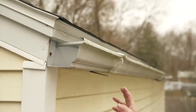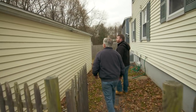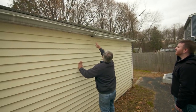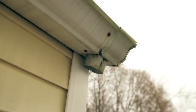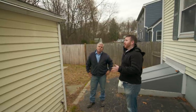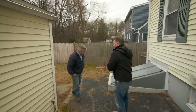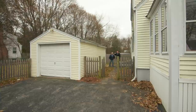There's no end caps here. Brackets are falling off. The spikes are coming out. This joint definitely looks like it will leak. There are no brackets on that gutter. You have an outlet for a downspout, then again, no downspout. The water is pooling here and I'm concerned about it getting in the basement. I thought about putting the downspout in the driveway, but in the winter, the ice — you don't want that. So I'm hoping you might have some alternative.